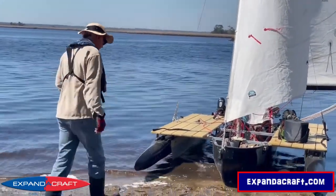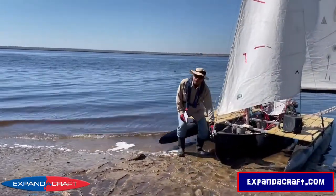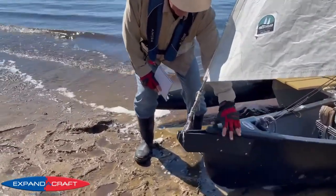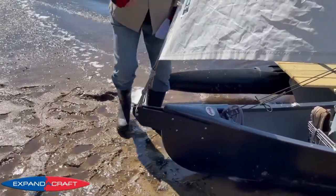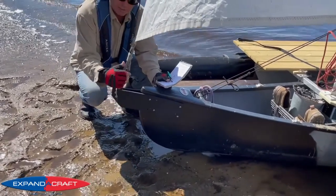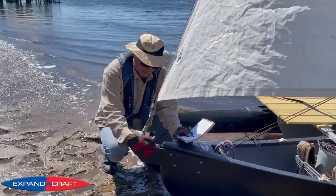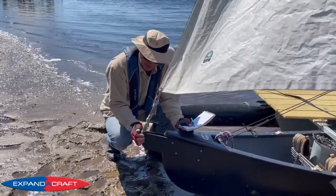Come this way. Right here, you see a strong point. This strong point is kind of a bowsprit. It is starboard. You can see it comes on both sides. I've got bolts that hold it in. The bolts make sure that this is very stout and it spreads the load, because this is seriously loaded here. You can't just stick a hole in the plastic and hope that that canoe will hold you. So I've got this. It also elongates that even just a little bit.